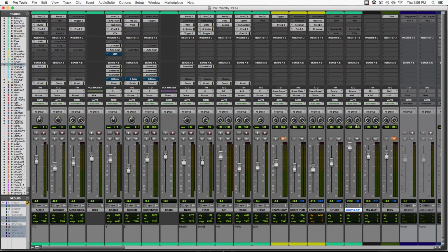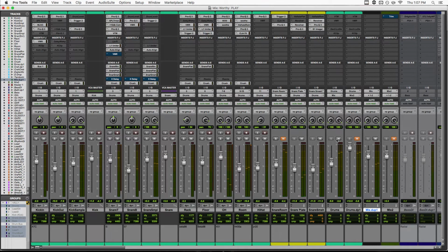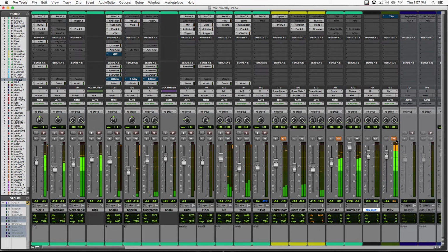The only difference is the level. I have this one cranked up super, super loud so that it will undoubtedly be going above 0. And then this one's at a more reasonable level. And then they're going to 2 identical buses here. So first, let's take a look at our low level one. That sounds good, obviously. Now we'll unmute this one. I'm going to leave this muted because it's going to be really stupid loud. But you can see here, we are going almost 9 decibels over 0.